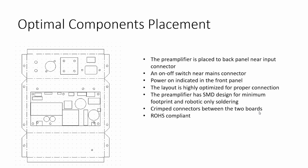Actually, it is a significant saving of manpower costs for assembling. We managed to keep all signal connection cable lengths below 100 mm. It is okay to just twist the cables to achieve maximum performance. No need for shielded cables inside the case.